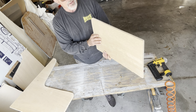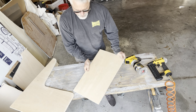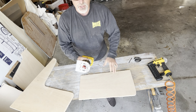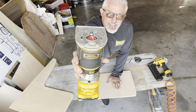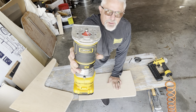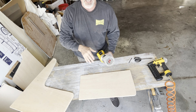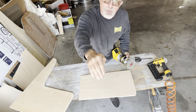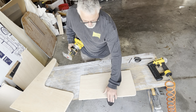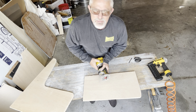This is going on that side, so this is going to be the inside. This is the edge I want to trim up. I'm going to use that old router bit right there — you can see it. We use this same bit a lot on our cabinets. I'm just going to trim up here to make it nice and smooth with a nice little curve, and it's going to match the cabinet doors.